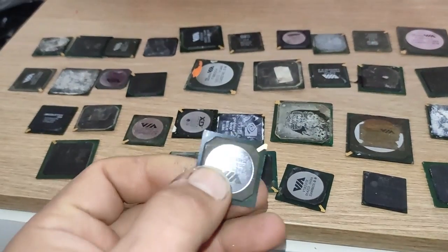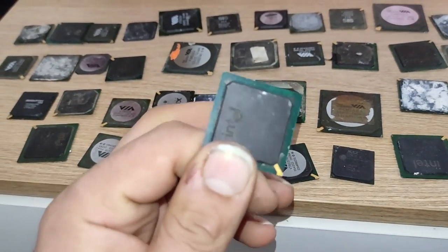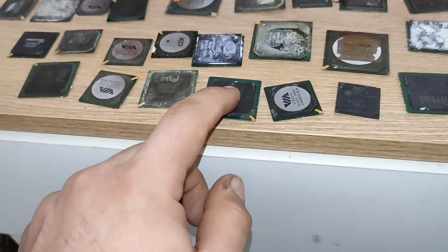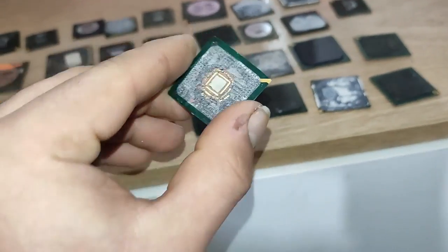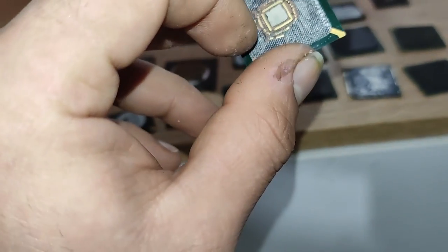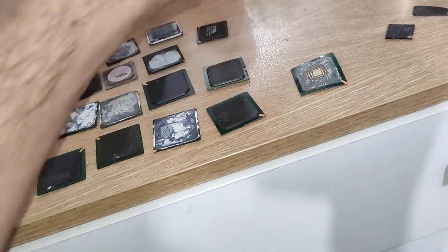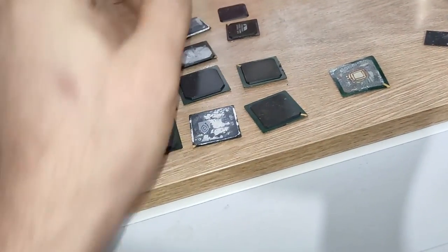Some of them have copper heatsink on the top and some others have no heatsink. These chips without copper heatsink usually have more proportional gold compared to their total weights. Usually refiners process the bottom layer separately, but what I'm going to do in this video is to process them all together, epoxy layer and bottom layer, since some gold sticks to the bottom layer while separating epoxy.